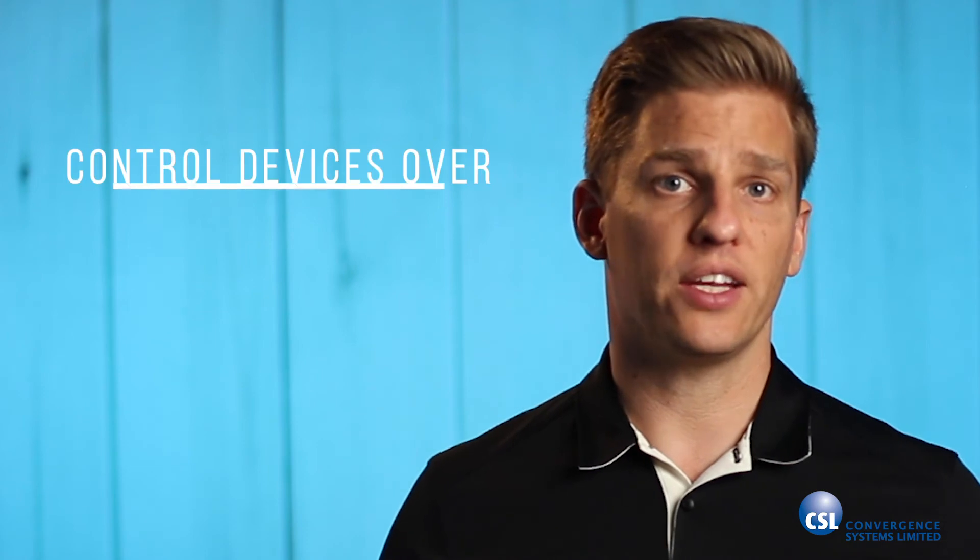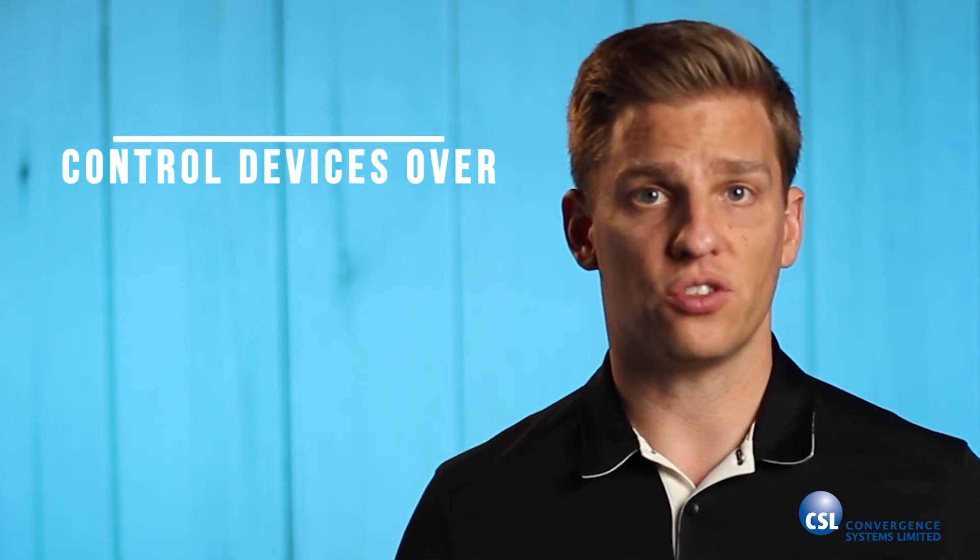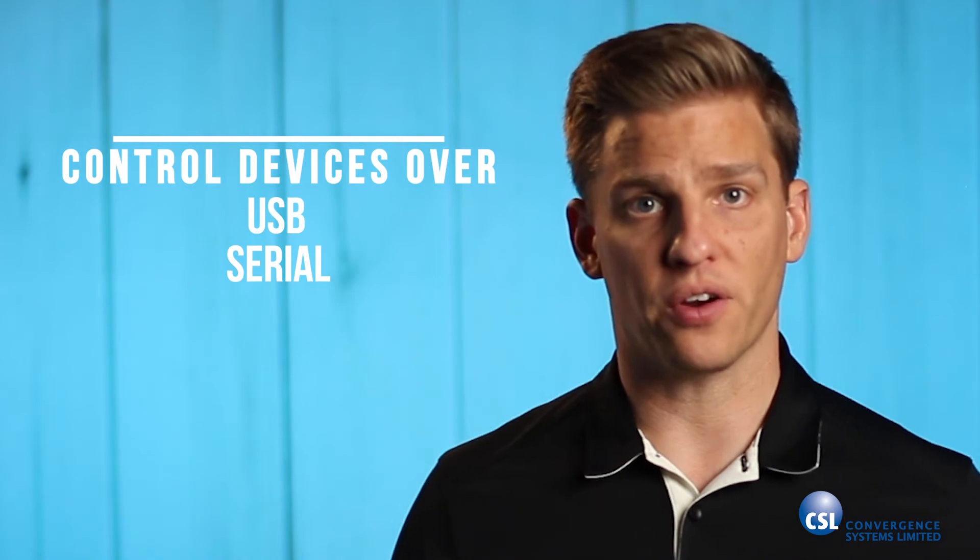The CS463 is built on an open Linux platform, and that means you aren't limited to the logic of the event engine or even the GPIO of the reader. Developers are free to create their own custom logic and even connect and control external devices using the USB or serial connection. Running your own embedded code enables readers installed in remote locations to have advanced logic running right on the reader without a network connection. In another scenario, it enables the reader to pre-process tag reads and GPIO events with custom logic before communicating to the cloud.